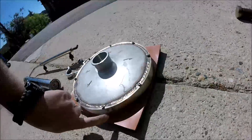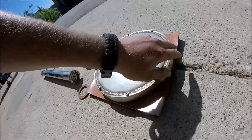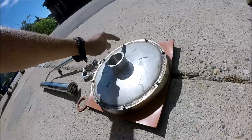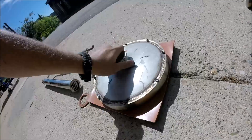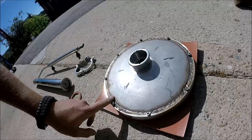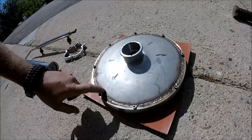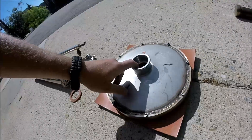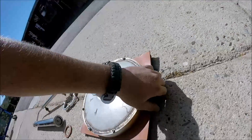The other thing was this is 316 stainless, and I think it's been hardened because I ended up breaking a whole bunch of carbide drills — not even trying to drill through it, just trying to widen some existing holes. It's the hardest thing I've ever had to drill. I chucked it up using toe clamps in a drill press and held it under water while drilling through the holes with a carbide drill. It only worked once or twice; the rest of the times I broke the drill bits off and ended up having to punch them out and use an undersized screw.